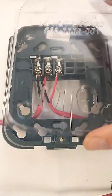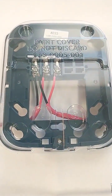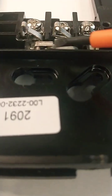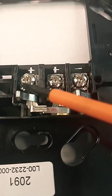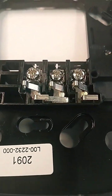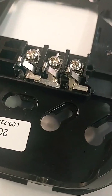If the walls haven't been finished yet, you can put the protective cover on that came with the unit and install the device later. There's a shorting clip right here that will maintain continuity between the two plus terminals so you can meter out your wiring before the devices are installed. Once you plug a device in, this contact will open and stay open forever at that point.